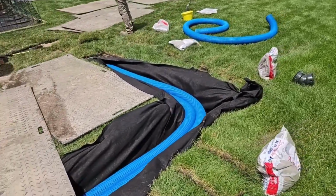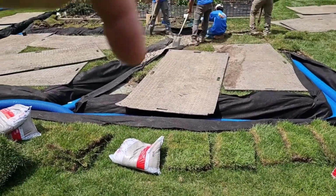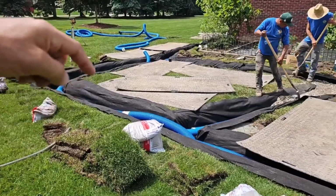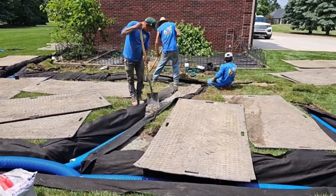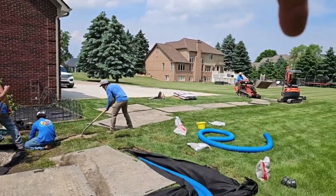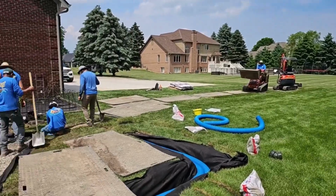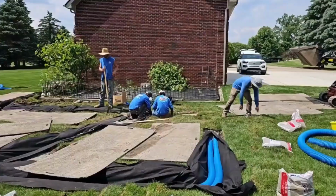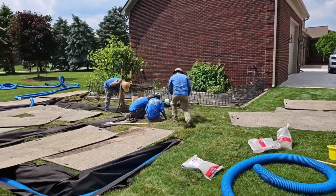We just have 2 pipes right here. You start your line out really shallow, and then as you get closer to the sump system, you go deeper. So this was a nice shallow dig, which worked out great because we had all those sprinkler mains. The trench that runs down the property in that swale gets quite deep, so then these just drop right off in it. You're trying to get deeper when you put slope on the trench, so you're trying to start as shallow as you possibly can.